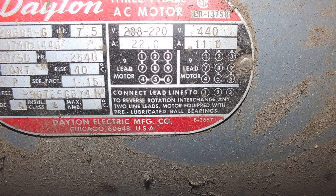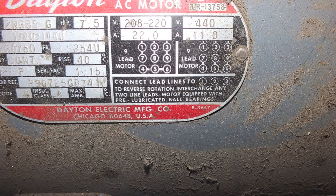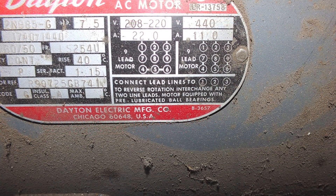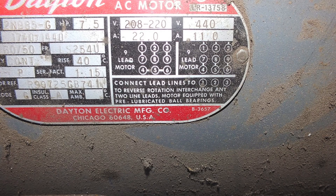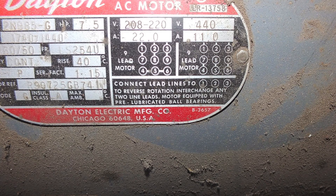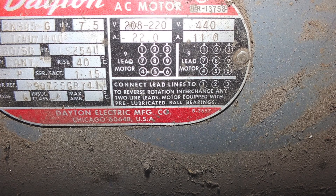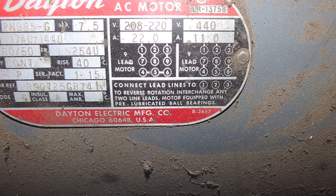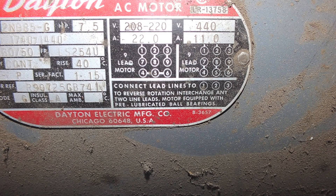Let's look at the left side of that diagram under 208, 220. If you look at that, look at the very bottom - 4, 5, and 6 are wired together because those lines between them. One's wired to seven, two's wired to eight, three wired to nine. And then on the top, you can see little wires coming out of one, two, and three. Those are your power coming into the motor.